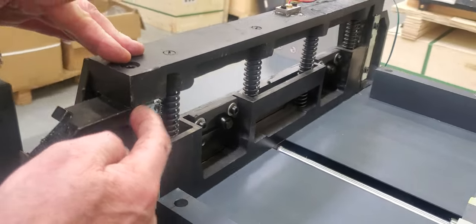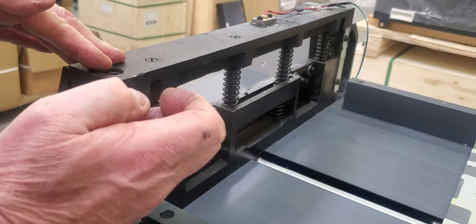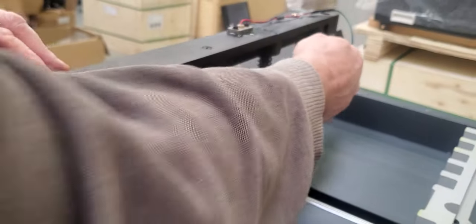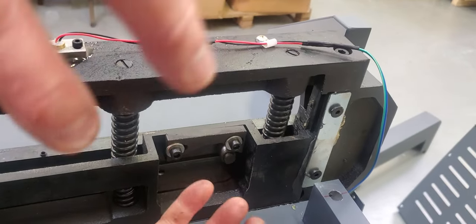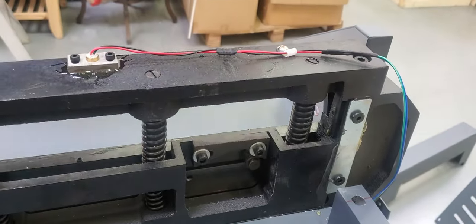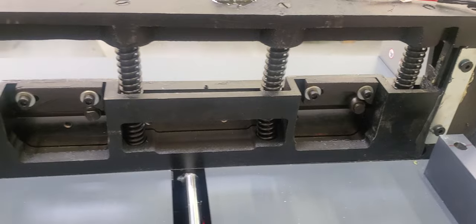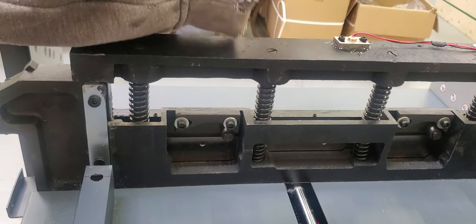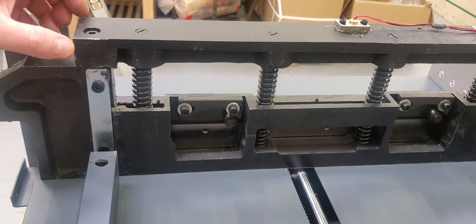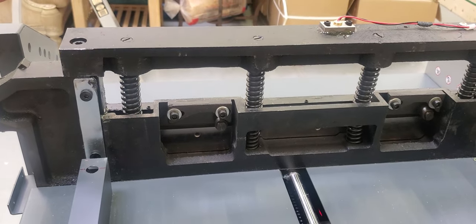Before you loosen it, pay attention to how this is corresponding to that. I would take pictures at different angles close up. Sometimes they're perfectly flush — if that's the case, great, just get it perfectly flush. Check the other side too. Sometimes there's a gap where this hangs over it. Take pictures from different angles so you can see left and right, and make sure you label which side is which. The reason you want to do this is because it affects your laser light and how it shines down on your paper.